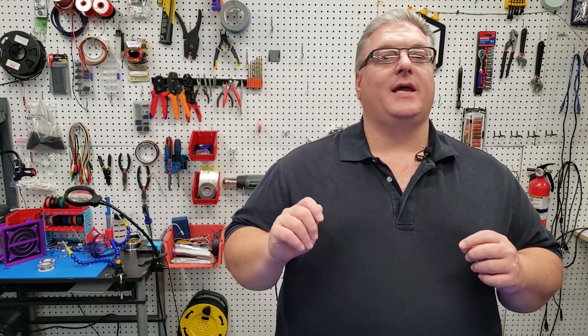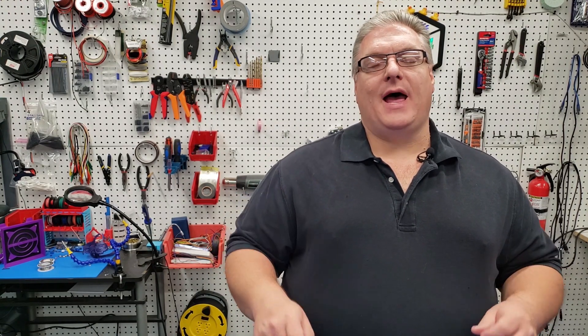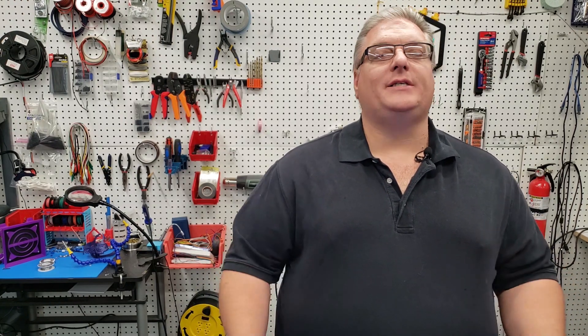As you can see, this is pretty simple to put together — a little bit of soldering with the circuit board. The hardest part is really getting the NeoPixels fed through with the wiring, and then making sure that you crimp the ferrule connectors after you get it through the connector on the bed. Put those connectors on the wires, then hook it all up and plug it into the SKR. It's a pretty simple process to get this up and running.